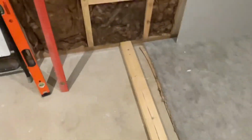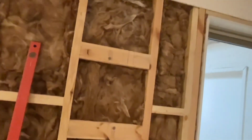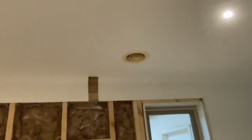So now the plan is we'll put a stud up against this wall, and I'll leave enough gap at the top to slide the top plate in. That way I have something to rest it on while I try and fix it to the ceiling at the other end. Once it's fixed up this end, it's just a matter of nailing along for a bit more support. And that'll be going into the roof truss.